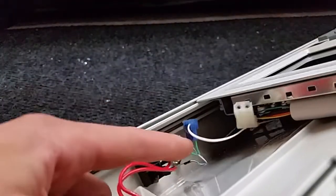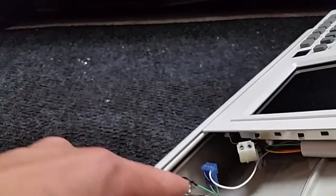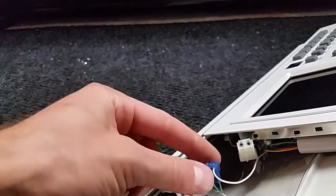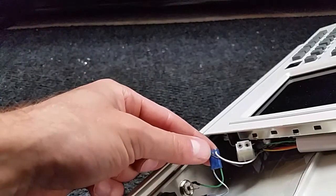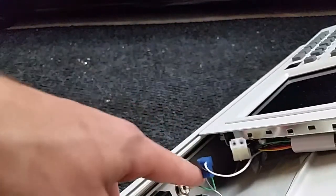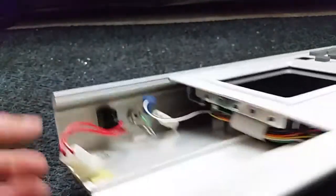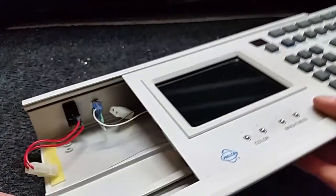There's one other connector to undo. I unplugged it from the board and tied in regular BNC into the connection labeled 'video' - that's it. I drilled a hole and put in a panel mount BNC connector. The black is the ground and the positive is the video core. The whole thing slides out and you'll see this two-pin connector on the board plugged right in, labeled 'video'.